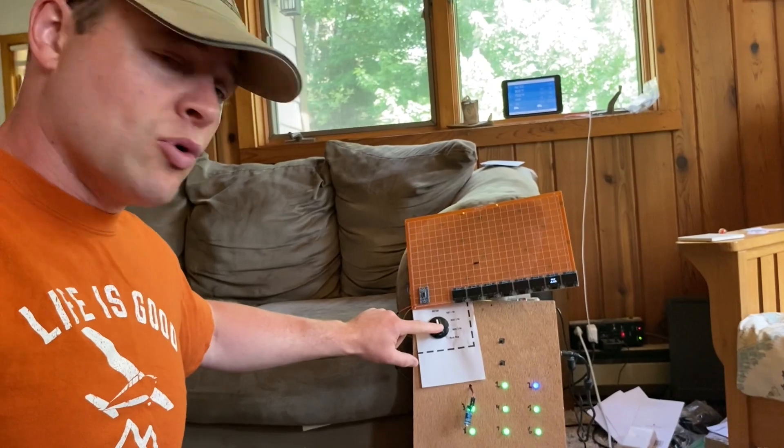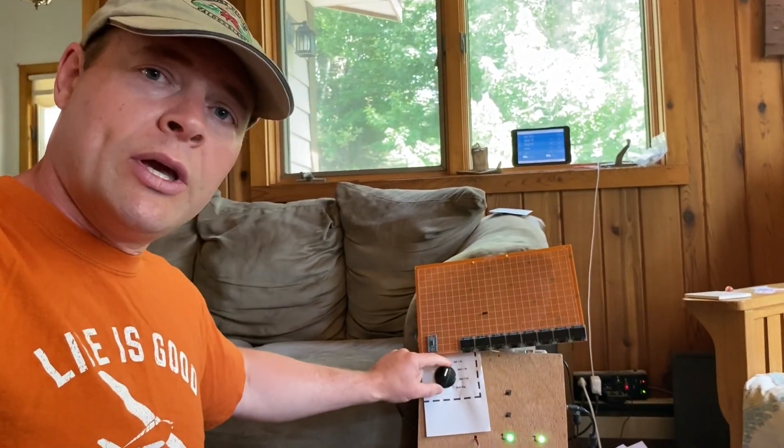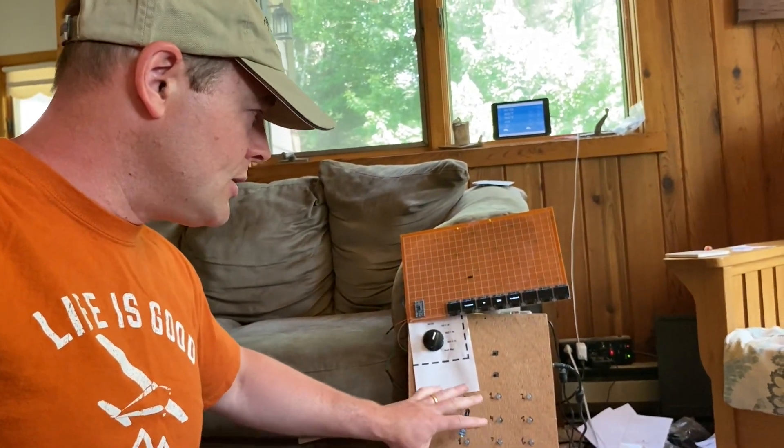We've got a bunch of new features with this version 4. One notably is a rotary switch. We have the ability to have a rotary switch in your project where someone can walk up and flip the switch and it will start showing different data. By default, the map will show METAR data, but off this switch you can have it show TAF data — one hour, two hour, three hour, four hour TAF data. It'll also show MOS data, that new kind of MOS information we're getting from the FAA — you can have it showcase that forecasted weather one, two, three, or four hours out. You define what you want the switch to do, and the switch is super easy to wire into your Pi.